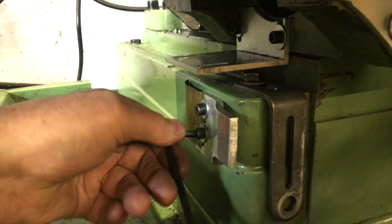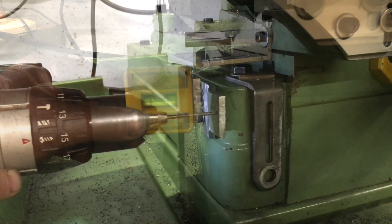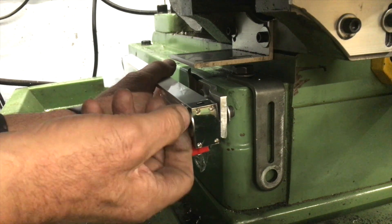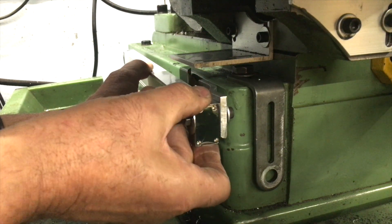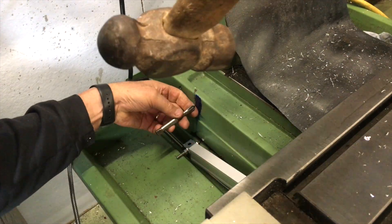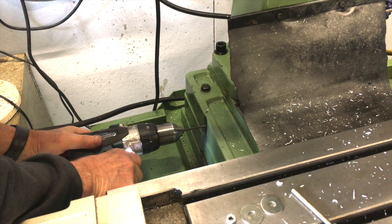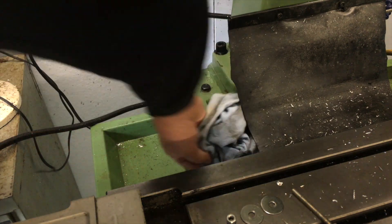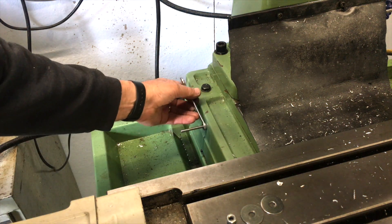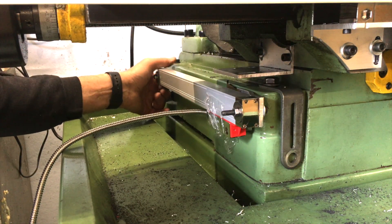I reckon the shim should be large enough to deflect a torrent of coolant. Before drilling a 6.5mm hole I confirmed that the scale support was vertical — if it needed a bit more tweaking it could be done in situ. As with the other scales I used another penny washer to hold the scale in place while the adjustments are carried out, but for the moment its only task was to stop the scale from falling off the bracket. As I was going to use another stud at this end I used the same idea employed on the lathe: a sharpened stud to mark the correct linear distance before drilling and tapping another 6mm hole to mount the stud. With the stud and locking nuts and penny washers in place, the scale was mounted and set to the correct alignment, and checked with the DTI in the usual manner before the lock nuts were finally nipped up.